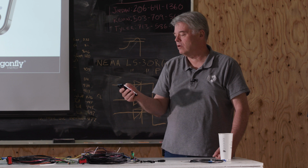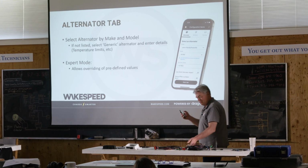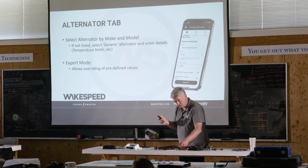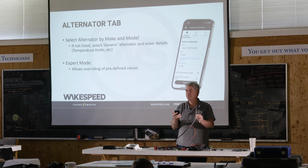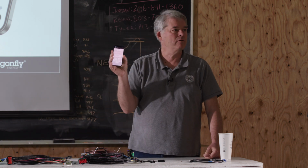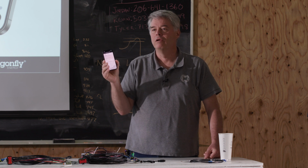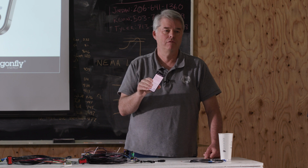I will tell you another little detailed hint. This is a super advanced capability, but you'll see it used in some of our configurations. The white feature in has the ability to select half power mode. Do you remember me talking about that? If you put 0% in for half power mode, that will tell the regulator to go into standby. It's a way to turn the regulator off without turning it off.